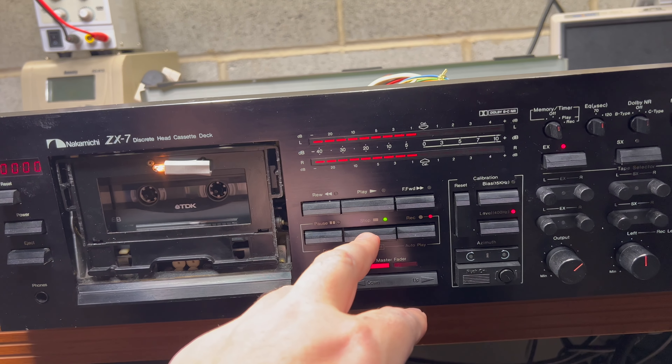After a while the counter just started working by itself when I touched the boards — so probably something is unsoldered or one of the connectors is loose. At least the counter works now, which is a good sign. I need to probably resolder the counter connectors and maybe other connectors. Moving on.